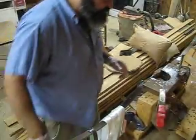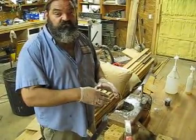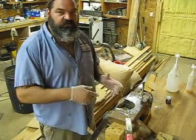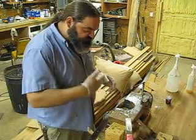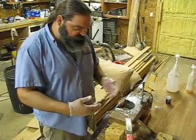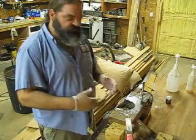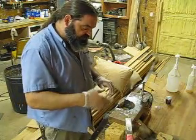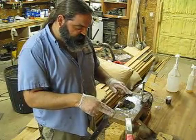If by chance you run out of fiberglass or you run out of resin before your sleeve sets up and you can get it finished, you have to let that harden up overnight, and come back and sand all the roughness off of that till you get down to a coarse sleeve, kind of coarse like you would sand your wood, and then go back and re-wrap whatever's remaining. So you just want to grind it down till you get pretty much smooth all the way around, the coarseness of whatever grit you're using, and then go back and wrap the rest of it. When you do that, you can usually take it out of the jig to finish it up. It's not too big of a deal.